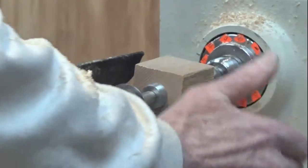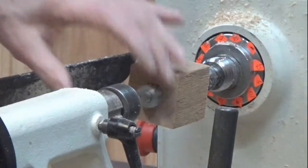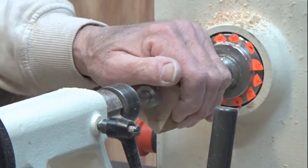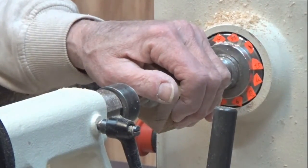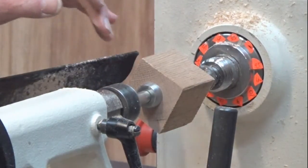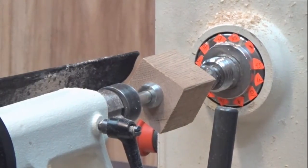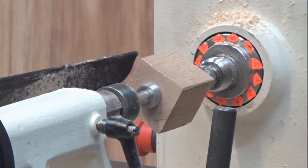Kaleidoscope. Do you use the high friction polish on those while you're turning them? No, actually what I'm doing on these is just sandpaper and then taking them straight over and spraying them. On some things, depending on the wood, sometimes I might spray one coat of shellac first. And the best thing about it is, if you're spraying and you're not turning it like this, you're going to have high spot, low spot, high spot, low spot. And the easy way to get rid of that is just going like this, and it all just settles completely out.